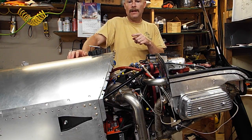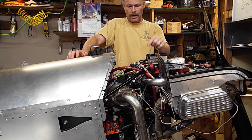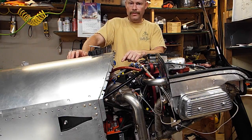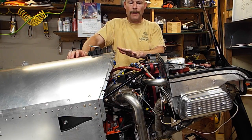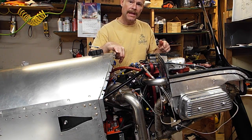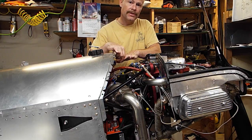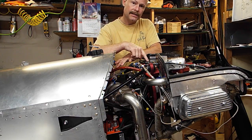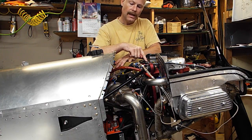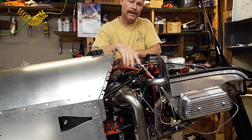The manual said that when you cut the electronic ignition, the coils, there should be no RPM change running off the mags. But it said that when you cut the mags out and you're just running on the coils, there should be 50 RPM or less drop. Well, what happened was, when I cut the coils out, my electronic ignition, my RPM dropped about 150 RPM. It dropped 100, that's when I cut my coils. So in theory, I should have been just running on my mags, and they said when I run on just my mags, the RPM should not drop. Now when I turned off just my mags, nothing happened. Everything stayed the same RPM.